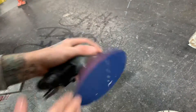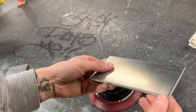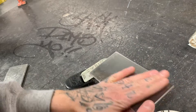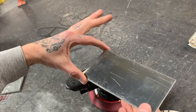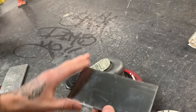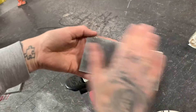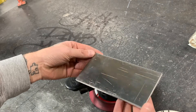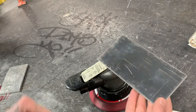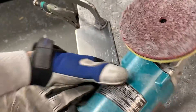Basically what you're trying to do — the scratches are going to show really, really blatantly. So the rougher stuff first, and if you flatten it with a 3M grinder or something like this first, like a scotch pad, you can remove a lot of these scratches first, so that when we start the sanding process, we're slowly eliminating the top surface, bringing it down so that when we get to the polishing stage, there's no blemishes left from the grinder, sander, or the scratches you see here. So we're going to start out with the grinder.